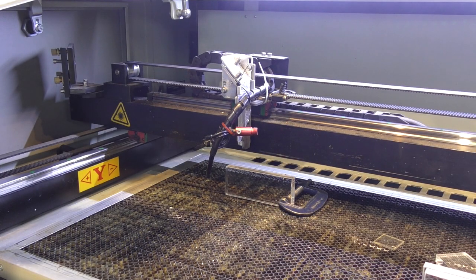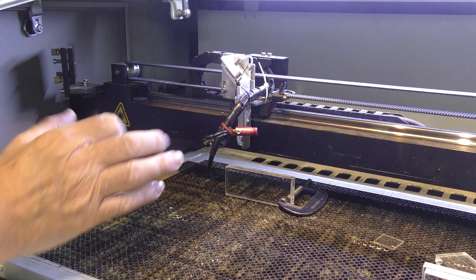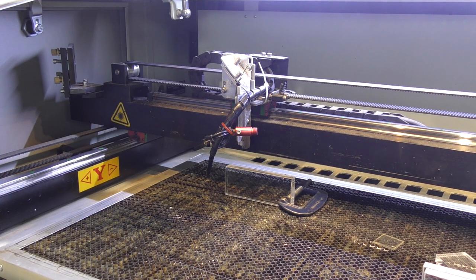I used to own a sheet metalworking business where we had a very old cross-flow CO2 laser for cutting metal. And that laser regularly required its mirrors to be adjusted and tuned. And one of the tricks that I learned in those very early days was something called a mode burn test, where we had to use a piece of acrylic to check that the mirrors were set up correctly. Now, that's a trick that I never lost sight of, and acrylic has become my favourite friend for the CO2 laser. And I'm going to show you how important this procedure is.